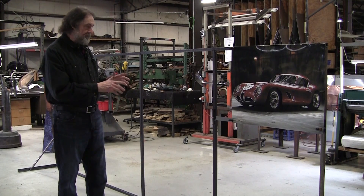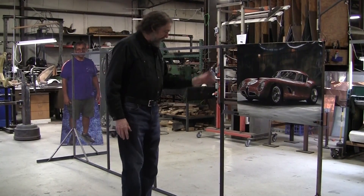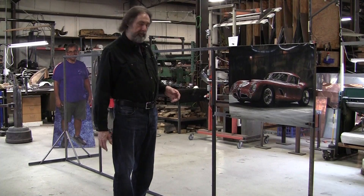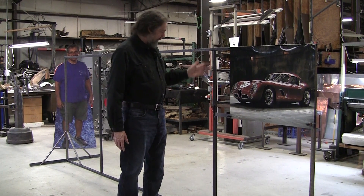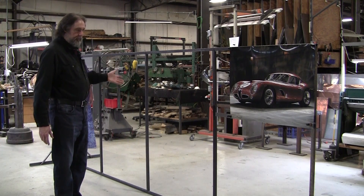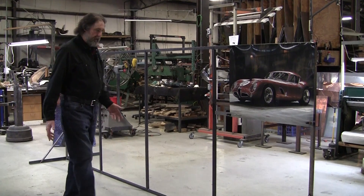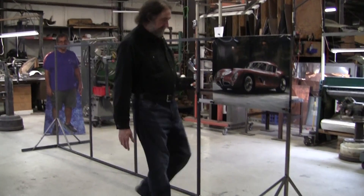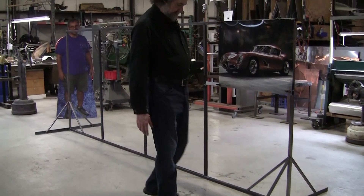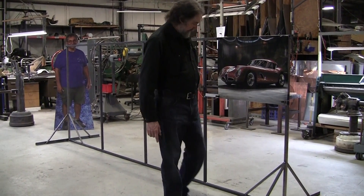Then we made it very square. I made a big giant square that I use in the shop for general purposes. All of these are square within about 30 thousandths or so. It's just MIG welded together — very simple to make. We gave it a little 45-degree reinforcement with some three-quarter square and a little piece of one-and-a-half-inch, eighth-inch leg angle iron.